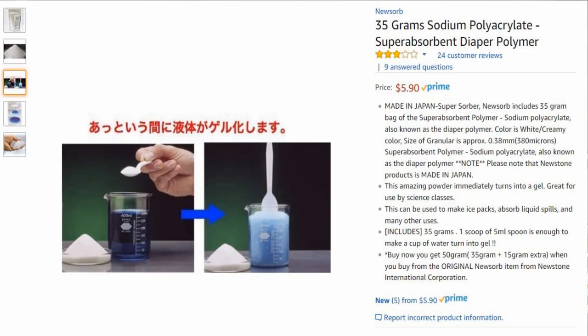If, on the other hand, you want an inexpensive option to make a whole ton of these for short-term energy storage from, say, a solar panel, in that case I'm going to recommend the sodium polyacrylate polymer available from Amazon.com. That super absorbent chemical does absorb a lot of water, so you need to dilute it heavily and then pour it over a substrate such as high-quality paper, let that evaporate, and repeat a couple times to build up a high concentration of sodium polyacrylate within the paper.